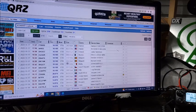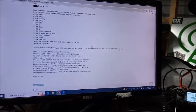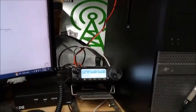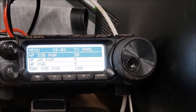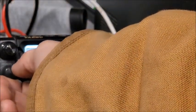I'm doing 30 watts right now. You want to make sure that on your radio settings — menu 1601 — you go in and I just have the sideband power set, and I always keep my HF power all the way down to 5 watts. I keep my HF AM power down at 5 watts as well, and HF power here down at 5 watts.